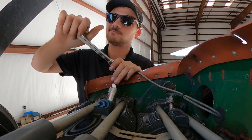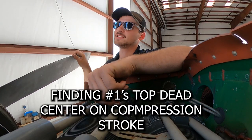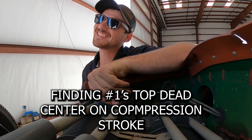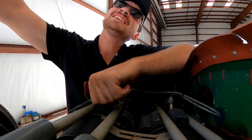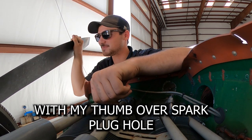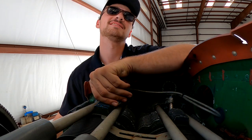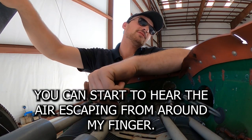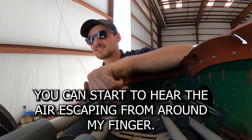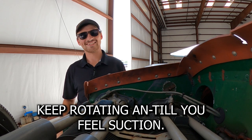I'm not doing this thing again. I did this yesterday. Put a mag on it, timed it, ran it. Oh, well, it runs good. Remove the mag. Oh, you just ops checked and made sure the mag was the issue. Yeah, because I think that's $1,200 sitting in that box right there. That would be the low end of my guesstimate for a magneto.